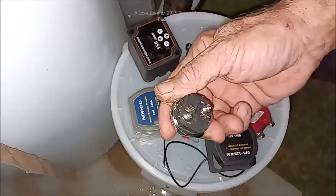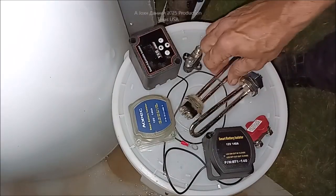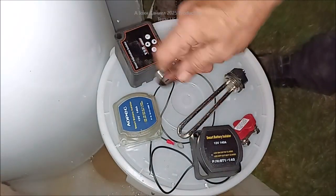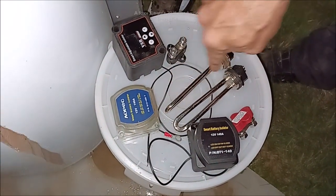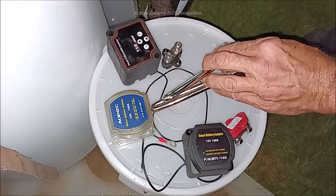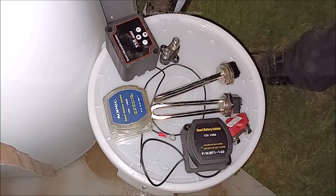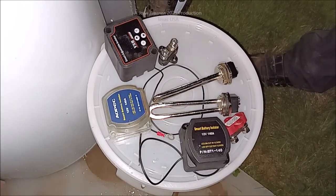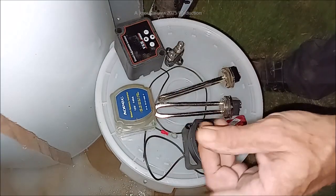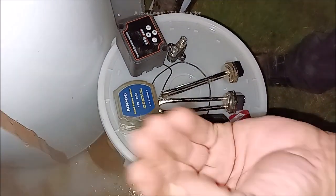This one here is a cheap stainless steel SES element — 300 watt. This one over here is 600 watt. I'll be putting double elements in this water heater at some point, but we're going to first start out with a set of these, which is 900 watts total. Believe it or not, when your sun's up all day long, it'll do a hell of a job giving you 40 gallons of solid hot water. Most people who are off-grid — when their batteries get to full charge around 2 p.m. — their solar controllers just drop down.